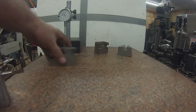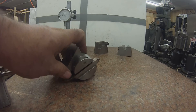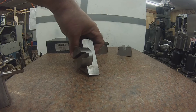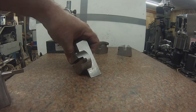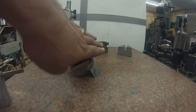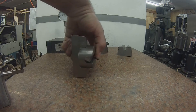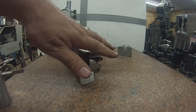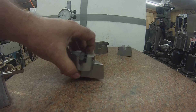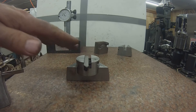We also made a tool some years ago for grinding threading tools — it's got all the angles built in too. See, this tilts down below straight and it gives you clearance on this side, which is the leading edge usually if you're doing right-hand thread. You clean this side up, you flip it over, clean the back side up. And you set it down on the base like this and you can grind the top — it puts a rake angle on there.